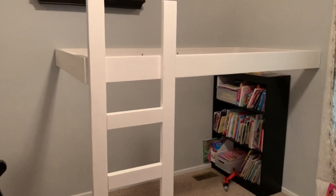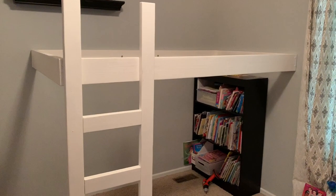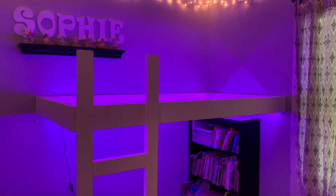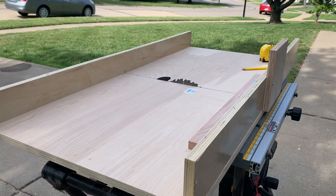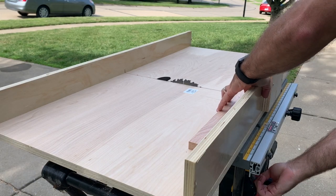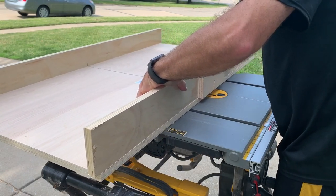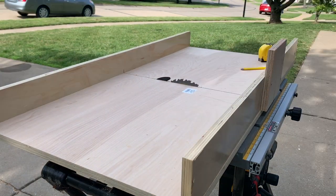When it came time to put it up in Sophie's room, we took the ladder and the frame up, laid the ladder down, and then 48 inches up the ladder we put the frame on top and screwed it into the ladder so we'd have some support as we stood it up. Then we screwed it in using the same lag screws into four studs on the long side and two studs on the short side. After that, we went around the bottom with the LED light strip. Then we had a chance to measure to see exactly how we wanted the railing — making sure it was low enough that she wouldn't roll between the rail and the mattress, but high enough that it wouldn't be a problem if she sat up and fell toward it. We put the mattress on the bed and had Sophie sit on it and held up the piece of wood to mark it, ensuring it was right for our seven-inch twin mattress.